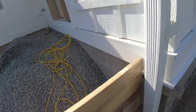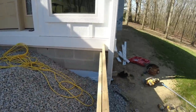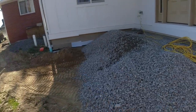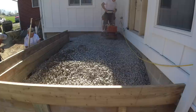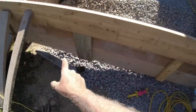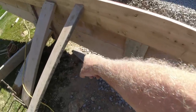There's my notch, all done — took me three tries. I could have deleted the first couple and said 'hey look at that, I got it,' but that's not how we do it around here. I'll run some screws from the outside in so I can get them out. We're good on stone — one more coming right here, we'll face this off. Just called for concrete — a couple more kickers in here so nothing pushes, just filling up that space on the bottom so nothing oozes out.